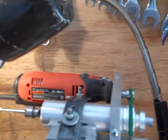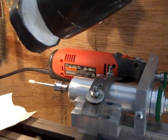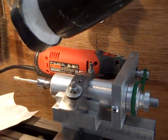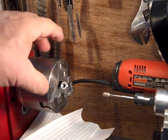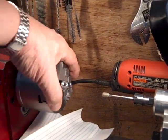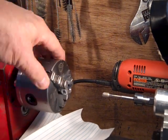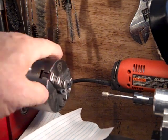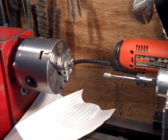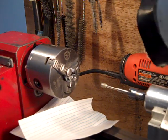This makes a lot of noise when I turn it on, so you won't be able to hear much. Notice I have nuts carefully placed in the jaws so I can tighten the jaws and put tension on them. You've got to put tension on the jaws when you're grinding them. These jaws are just nuts.